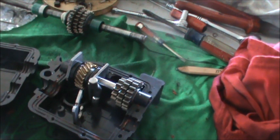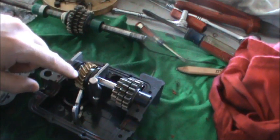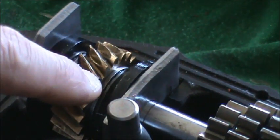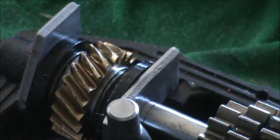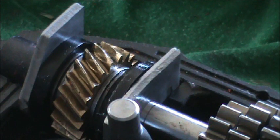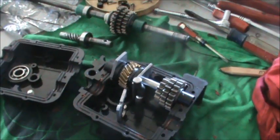One other thing I did: when I took this thing apart I realized I could actually flip this gear over. The teeth were slightly worn down and I couldn't find a replacement part, but by flipping the gear you get a better bite on the worm gear that connects to it — the angle still goes the same way, just reversed. I'm happy I had to take it apart because of that — it'll last a little longer, and I wasn't able to find that replacement part anywhere online.